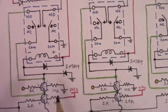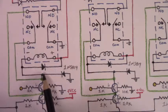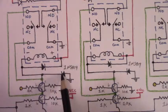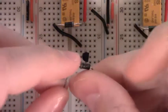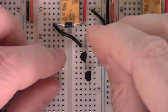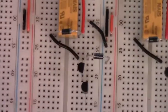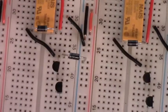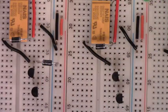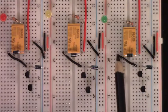We'll connect a Schottky diode with the cathode indicated by the gray band. We add it to the same row in the breadboard that the collector leg of the top NPN is located, with the cathode pointing toward the left side of the breadboard and the other leg going to the ground rail. We'll do that for each circuit. We've added those three protection diodes with their cathodes pointing to what, in our case, is the low side of the coil.